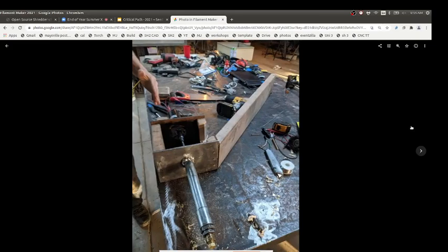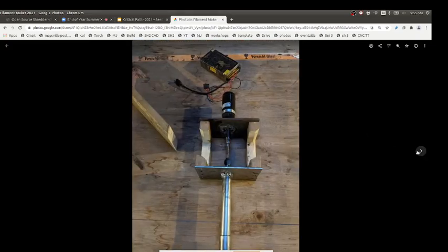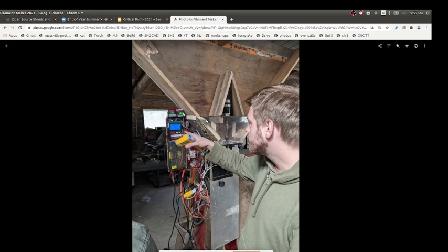The motor needs to be secured. The plexiglass hatch and the screws that mount into the plate of the motor all need to be attached before you start running things, otherwise it'll break off the wooden parts. That plexiglass must be in place. There was quite a bit of upward force — the wood at the notch just broke and went up. I put two screws in and think that ought to be as strong as before, since it broke along the grain lines.